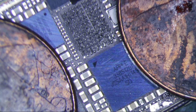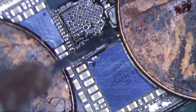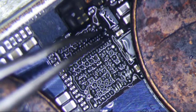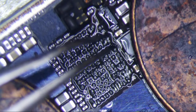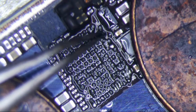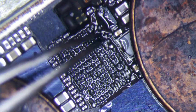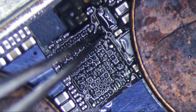Chip is taken off. Let's remove some of the leaded solder — lead-free solder. You can see a little bit of oxidation already. If you look closely here, you can actually see the oxidation on M1, but more importantly L1 is the usual culprit for touch IC disease. It didn't take a lot of force to remove this solder ball from L1, and you can see M1 is dying but it's still attached. So the usual culprit of touch IC disease on an iPhone 6 is that pad right there, L1.